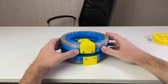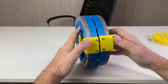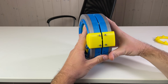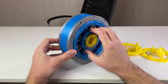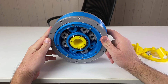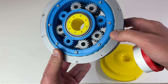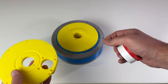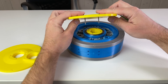Now we can assemble the two pieces. As you can see it's still not perfectly aligned, so I need to push this part inside a little bit to put the planets and sun gear in the middle. Like this it aligns, and now I can push the two parts together. I can unmount the helping tools. Now I need to secure the two parts with screws from both sides.